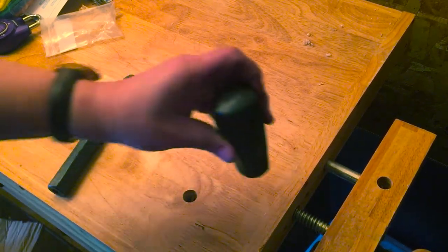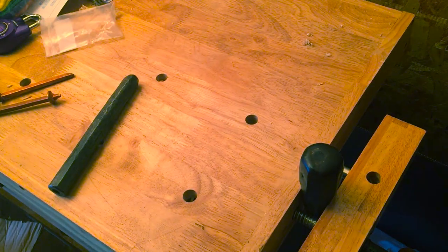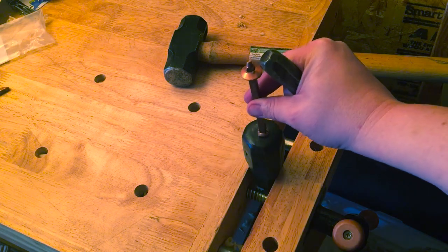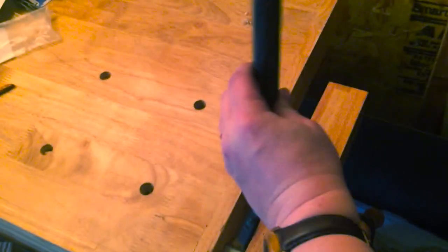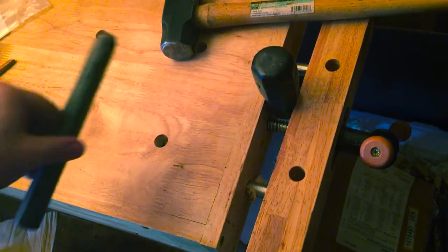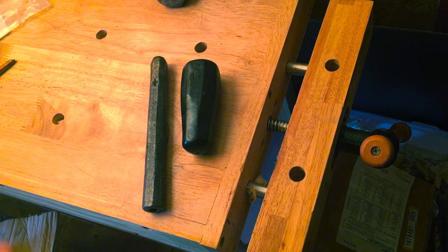Show you it in action. Put that on there. Basically rather than the device holding it, there would be a person holding that — you set that up there and hold on to it. It sets the rivet down, pull this off, cut the rivet off, and then pin the end. These are ready to go. Hopefully you guys like them and hopefully they work.